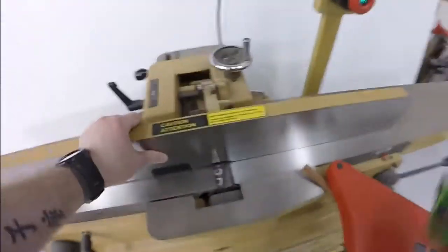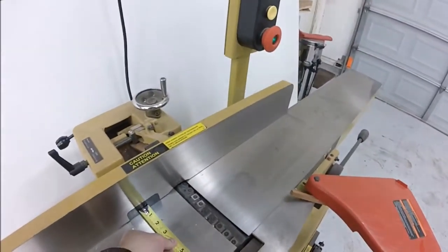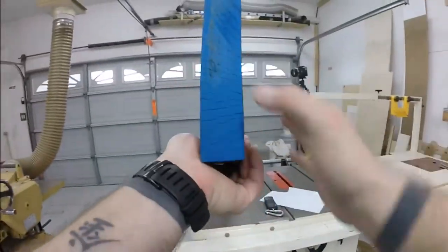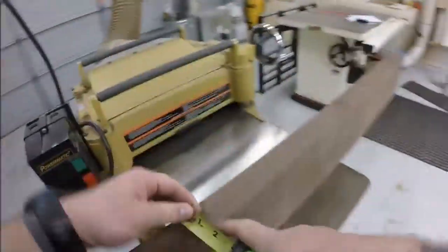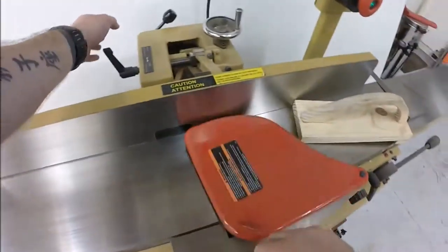Here you see me getting ready to make a profile edge on that dark walnut. Any milling you do with raw material, you have to make a flat surface to get yourself a profile. Since this material is raw, straight from the milling process, I have to make a flat profile. Here you can see I'm trying to figure out which side is cupped or which side is bowed. I personally like to use the cupped side — it's easier to work with than the bow side because the bow rocks a lot more. Some people prefer bowed; it just depends on how you like to work the wood.